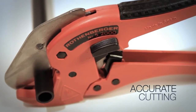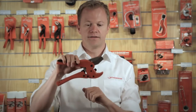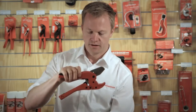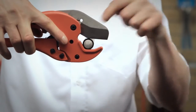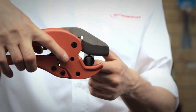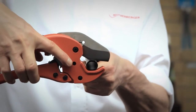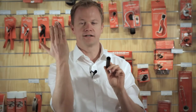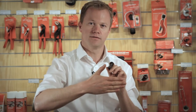The most important thing when cutting is that the pipe is not getting deformed, and that's what we ensure with this V-shaped blade. When you are cutting, the edge dips into the pipe tip-point first, then it's very easy to cut the whole pipe through. It's not cutting like a straight shear blade — it's cutting like this. That's the second advantage of the V-shaped blade.